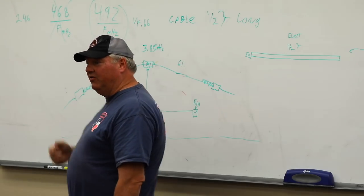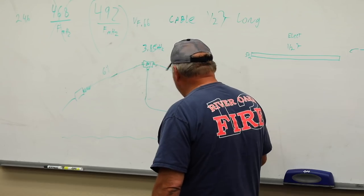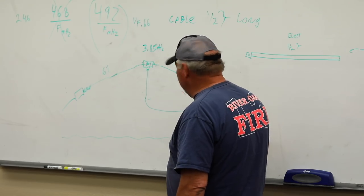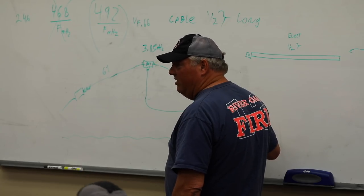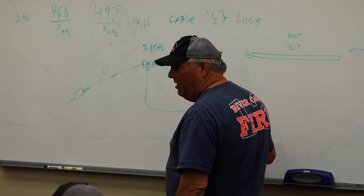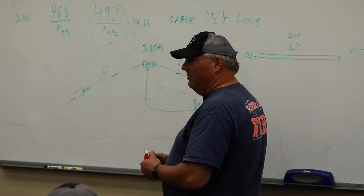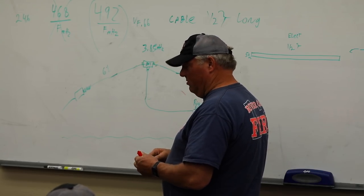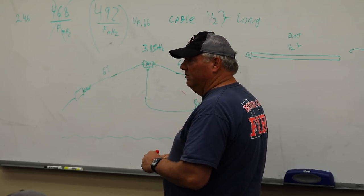Because your tuner is going to represent that 50 ohms right here, and it's going to take care of that extra length and goofy stuff, whether you got an amplifier, extra coax, your radio, whatever you decided to hook in. If you do this, and you say you have a real teeny weeny little backyard like mine, you say, oh, I got 85 feet of cable. You can still do it.